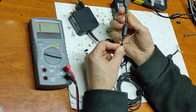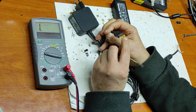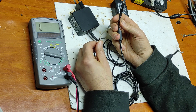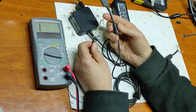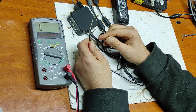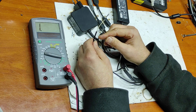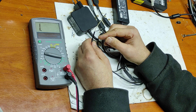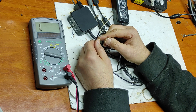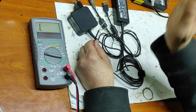That's why it's very important when you repair a power adapter and replace the connector to make sure the inside resistor has the same value in both the old and new connector, otherwise it will not work properly. If you are interested in power adapters, you can also watch similar videos about HP and Dell laptop adapters — you'll see the link on screen. If you found this helpful, please like and subscribe. Thanks for watching!